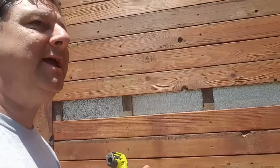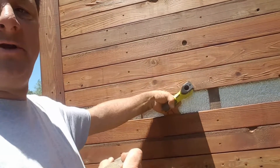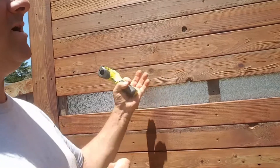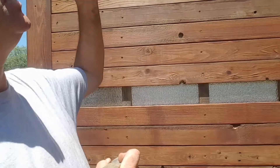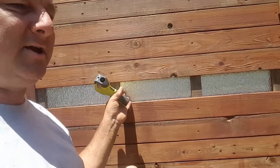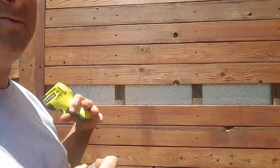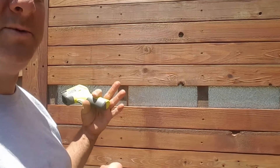We want to suck moisture out when we build a negative pressure against this wall as hot air rises. There's a 3/4-inch gap behind here. That gap allows the air in here to be superheated, rise, pull ambient temperature air into it, and cool as it goes out the top. It cools, it condenses, creates a negative pressure against the inside wall, and pulls out any extra moisture that's inside the wall — which normally shows up, especially in the wintertime, on your windows, and makes a small space uncomfortable when there's too much moisture.